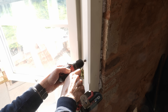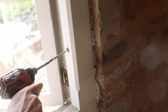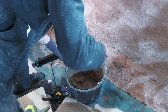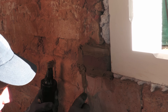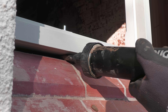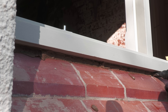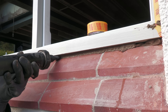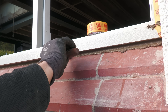Only when the foam is set do I then mechanically fix with frame fixings, because if you do it before the window's set it can slightly wander. Some people hide these behind the hinges but I prefer them to be more centrally positioned on the frame as it's so easy to fill the holes with two-part wood filler. The last job was to fill the gaps. Some people would use a frame sealant for this but I prefer the old-school method of sand and cement — it's worked really well for me, hasn't shrunk or cracked, and can be painted over for a seamless finish. Four parts sand to one part cement and I add a waterproof admixture to weatherproof and act as a plasticizer. And this is crucial, as I have a new favourite gadget: the mortar gun. It's made jobs like this effortless, although you do need to make sure the mix is the right consistency.